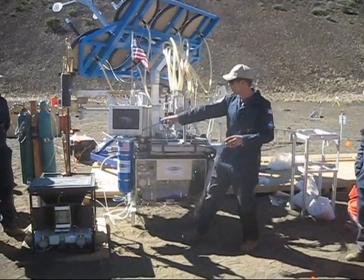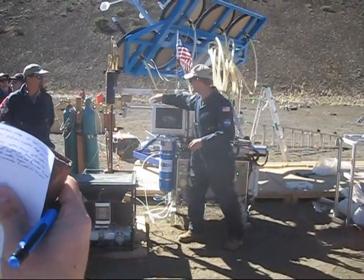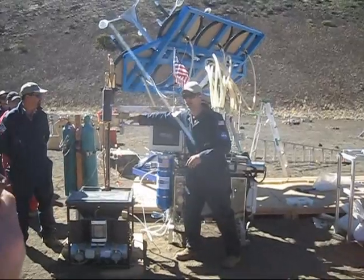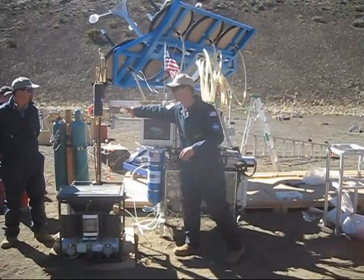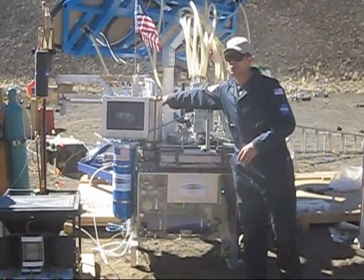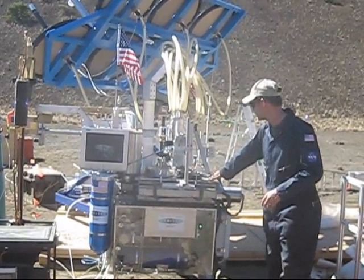Once the local soil is delivered up here, we open up two gate valves and this auger translates inside. We rotate the auger and move the soil inside our hopper while protecting the seals on the gate valve. When this is full, the auger moves backwards and we close those gate seals — now we have enough soil in here to do 24 hours of operation.